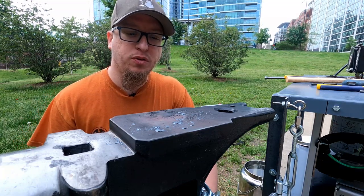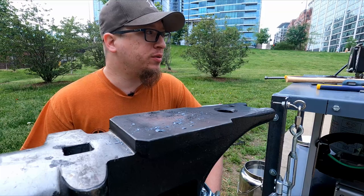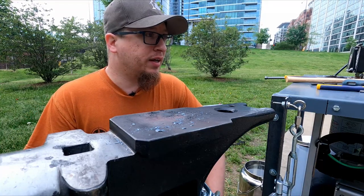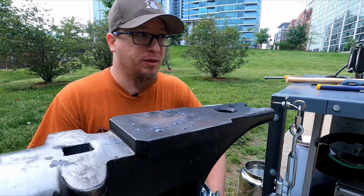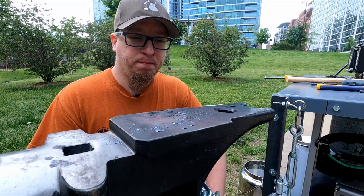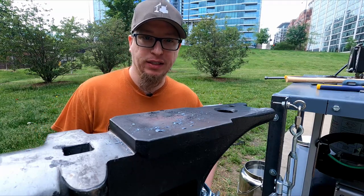As you can probably see, I'm still running into a little bit of issues with the big plug — it's kind of doing an hourglass shape. I think I need to go onto the sides and re-cylinderize it and then keep squishing it down. The challenge is I still don't have anything proper to hold it for that size stock, so it's going to be a pain. But I think that's what I'm going to do, and hopefully that solves the hourglassing shape.